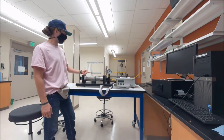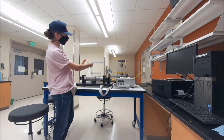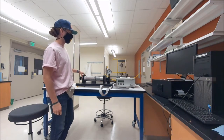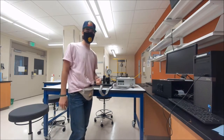When you put the plunger all the way in, basically this end cap has the plunger, and when you put it in, it allows the pressure to flow around, and the force is transmitted to the frame. So that configuration is the open configuration, which models a pressurized pipe.